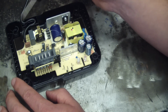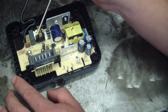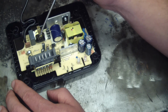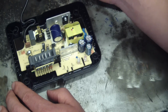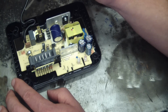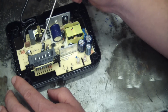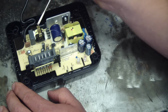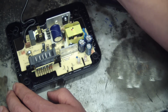So it'll input, say, an amp until the voltage gets up to 3.8 volts. I don't know what it is, I'm just pulling that out of my ass. And then once it's at a certain voltage, 3.8, good a number as any, then it bumps up to 4.2 volts and then just trickle charges until it tops it up until it's fully charged. But the thing with these is they're fast charged. Like you can charge one from dead to full in an hour, which is crazy. So that really depends on the C rating of the battery, and that's how much discharge and charge it's able to take. So those are super good batteries in those packs, and they can take quick charging.